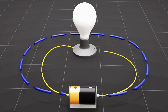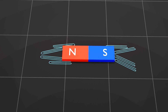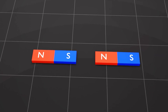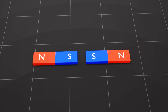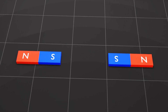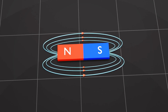Now let's move on to the next important element of the electric motor: the magnet. A magnet attracts nearby magnetic materials like these metallic paperclips. It has two poles, north and south. When the north pole of one magnet is brought close to the south pole of another, they begin to attract each other before they even touch. However, when two similar poles are brought closer, they repel each other. This force of attraction and repulsion from a distance is due to the invisible magnetic field, which is an area around the magnet in which other magnets and metals experience the magnetic force.